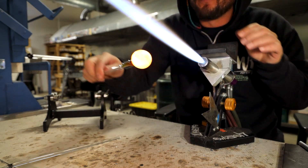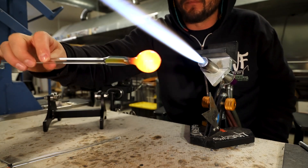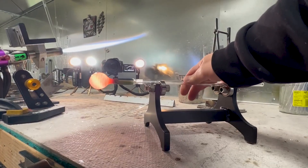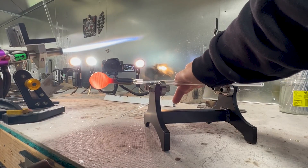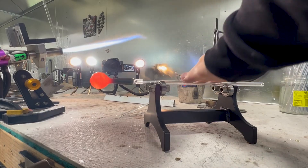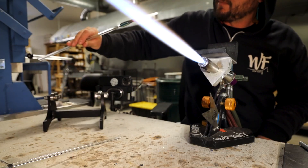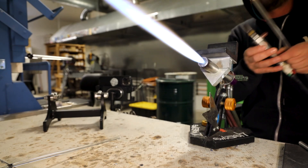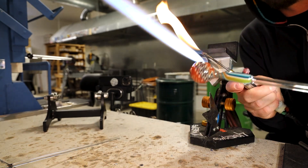There you could see I got it really ripping hot to get the final round shape — from that football to that final round takes a lot of heat, kind of juggling the glass. You can see there we have a nice round ball with a 360-degree spin in the wigwag, which will make for a really nice pattern in the finished product.